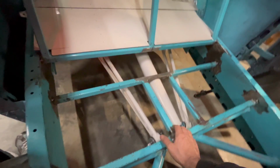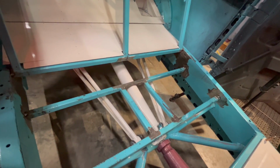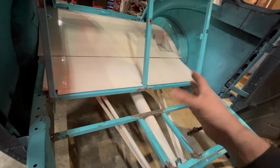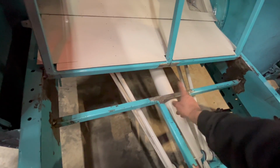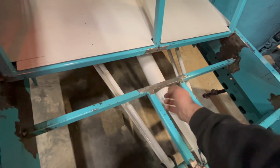Next, this is the structure that we changed. One of those modifications was I had a hoop here, a small hoop. But once we re-engineered the seat, we removed the springs in the rear of the car and jacked the suspension all the way up, and we oscillated it side to side, up and down. We realized that I didn't need this hoop. And what we did was I just took some 1-inch bar stock. Everything that was painted was here, except for this piece here. And then we basically C-notched it.